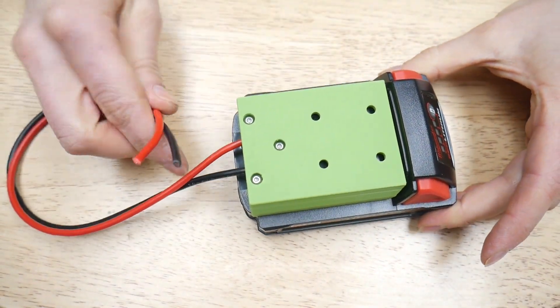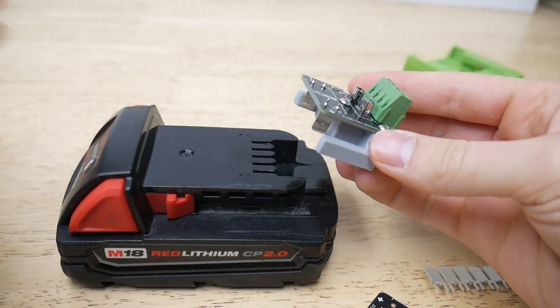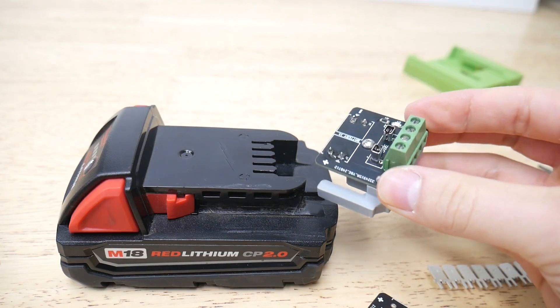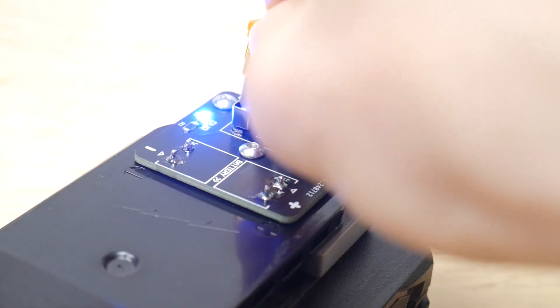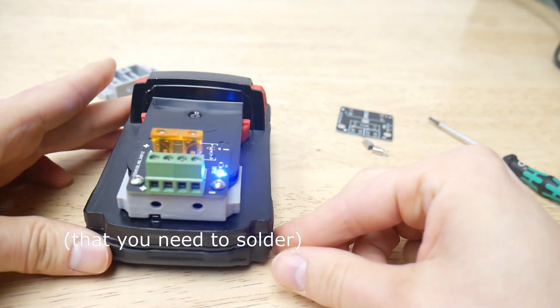This printed clip was my first attempt, but some projects are not all vehicles, and they might not need a clip solution that's so robust or mechanically clipped onto the battery. So I came up with this alternative, which is a printed circuit board with spade clips. The power is routed through an ATC fuse and broken out to 3.5mm pitch screw terminals.